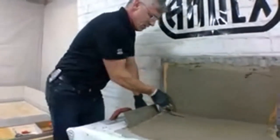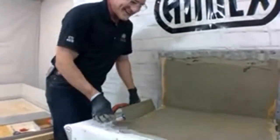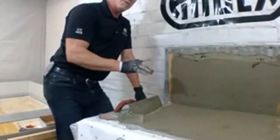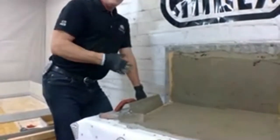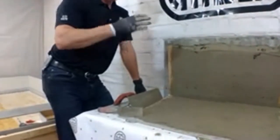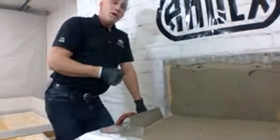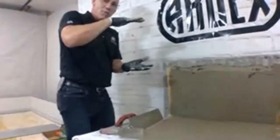Anonymous is asking if we can prime wood with 8+9 and then install AM100 on top of that. Okay. So again, our AM100 has to be in direct contact with a concrete surface. So whether that's a cement backer board or an actual concrete substrate, we have to be in contact with that concrete. We can't go on top of a fiber rock or some other sort of backer board. We need to be in direct contact. So that's important. And also, we always want to have our waterproofing as close to the tile work as possible. That keeps our entire assembly from being saturated with water.